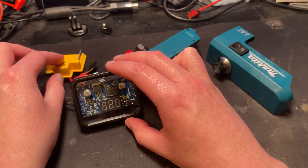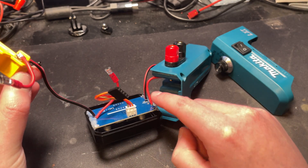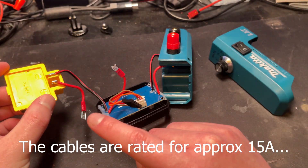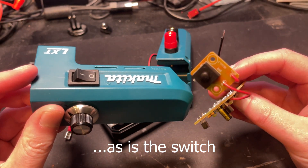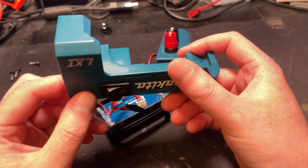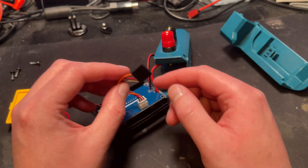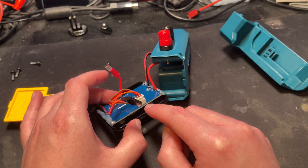So I'll show you around this a bit better. We have our Makita — if I flip this over, I'm being very careful because these connections here are not the strongest. I've tried to socket most things. So the two connections to the battery are just on there. This is intended for this switch which replaces the little push button — I just expanded the hole and put the switch in there and it's got its two little spade terminals on. It's quite tight in there with those two when you put it together. This is the connector for the potentiometer — this is the input side by the way.